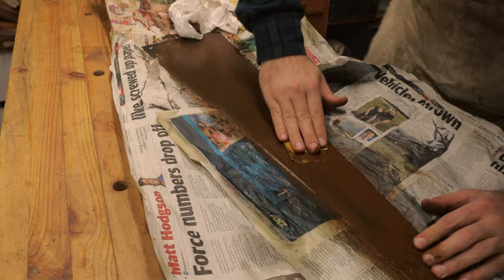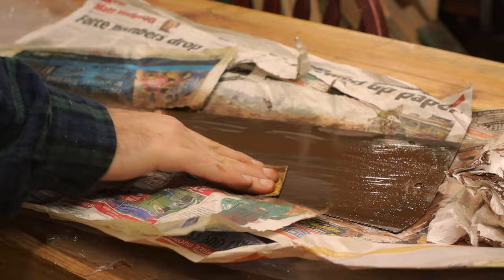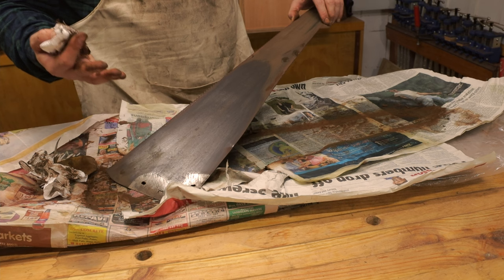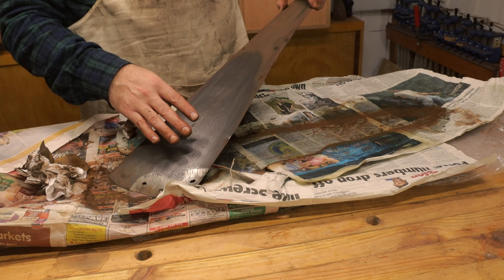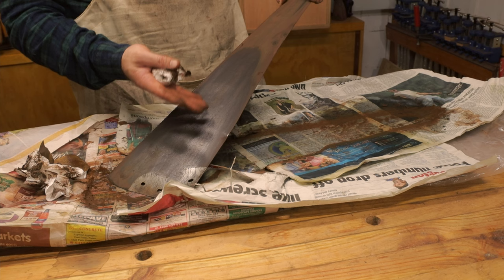We're starting to remove it and we're starting to see a bit of bare metal through here, but we've got to just keep going until we can see it right through. Some of these darker marks are pitting marks and we'll never remove those — you could, but you're going to remove too much metal and it's not worth it. The other thing is some of these darker marks that you'll hear some people say is actually patina. In some way it is a patina, but a lot of these darker marks are actually heavily ingrained rust. That brown or black color from the rust does help to preserve the metal and you could leave it or remove it — it just depends on the level of restoration you want to go to.